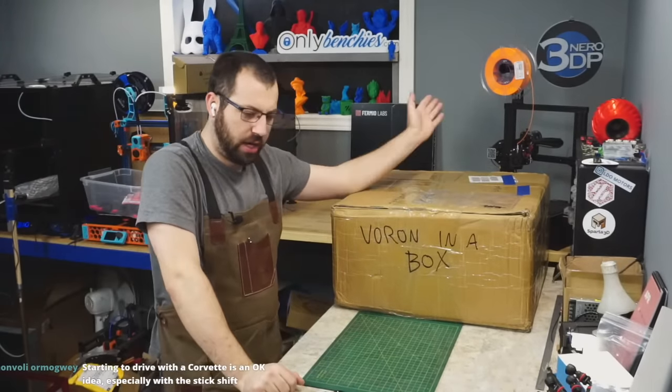So we're moving away from silicone. The reason silicone is spec is that it's going to be changing to PTFE. If you haven't bought your wires yet, get PTFE. The reason for silicone is Cat 5 was getting destroyed. There's a few guys on the team that play with the quads, you know, the drones, and silicone is super awesome in that, and it's super bendy. So we figured, hey, that's going to be great in drag chains. And it was okay-ish in the tape chain. But when we switched to drag chain itself, some of the cheaper chains wear through the silicone because it's soft.